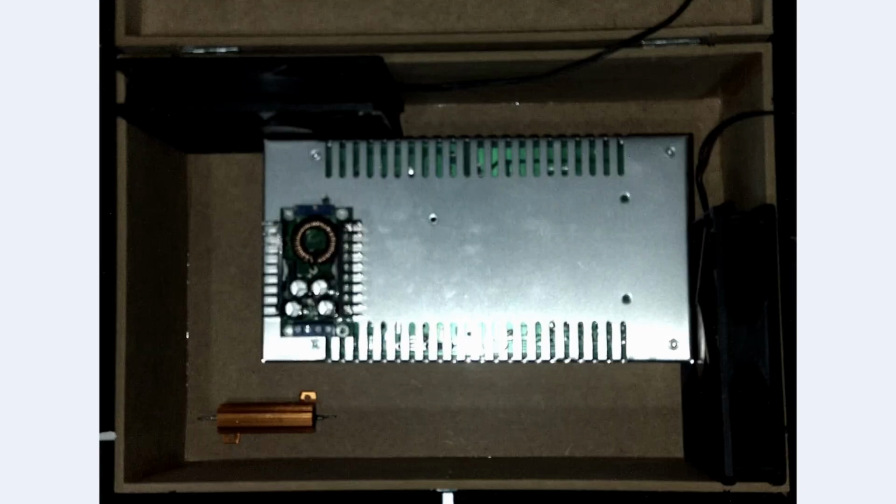And internally, I chose, you have some heat sinks in here and one on the side of the PSU. So I decided, well, if you can blow wind in here and then some wind can get on the cables here, then I've got the DC-DC converter and the power resistor used to test the maximum current all in the path of the wind. That would be great, and it's actually what I ended up doing.